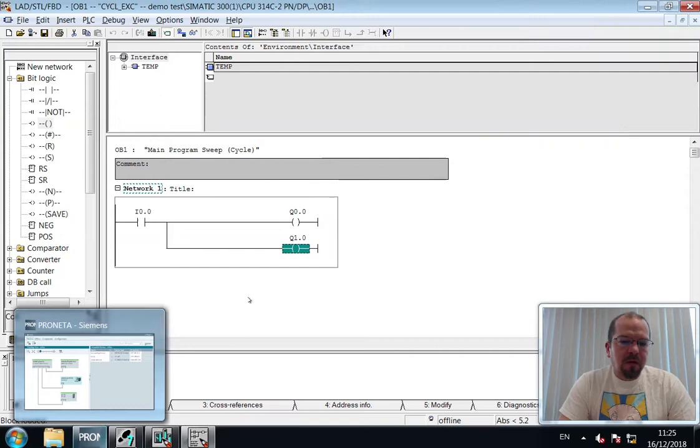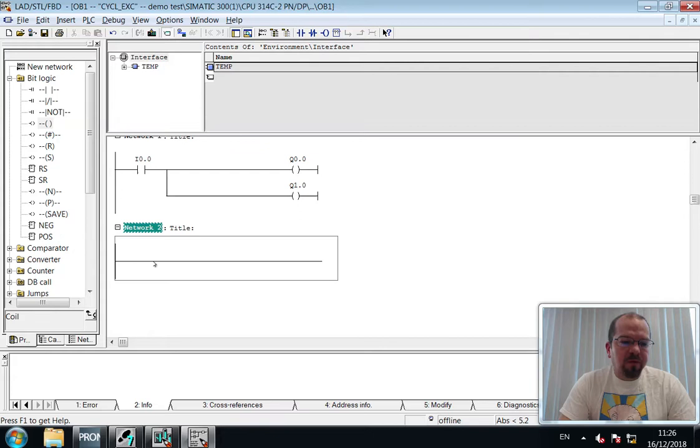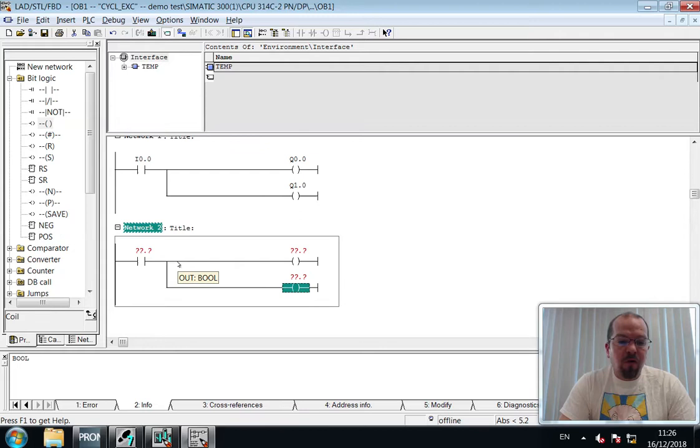Let's create a new network. New network. Okay, that new network's going to use a switch to control two LEDs. Okay, branched. They're going to be alternating, so we can either do this manually with a switch, turn that on and off, but to be more accurate, we should use a clock. So we'll also put a switch in there for a clock. Okay, so both of these need to be high for an output to occur here. But because we want, let's just do that, shall we?